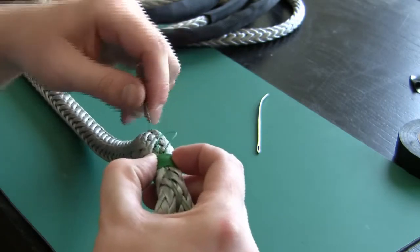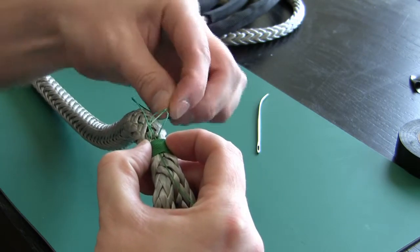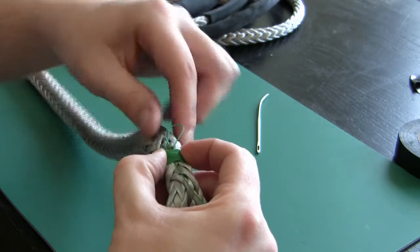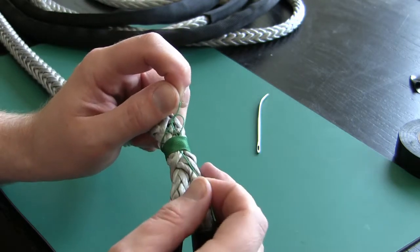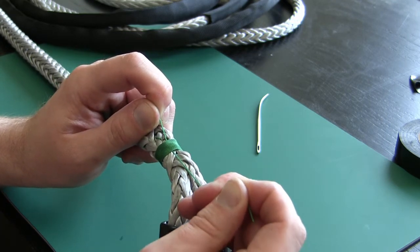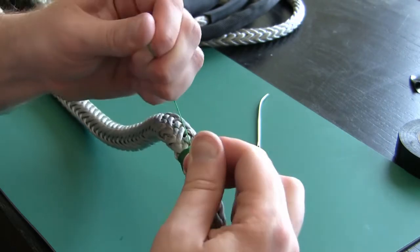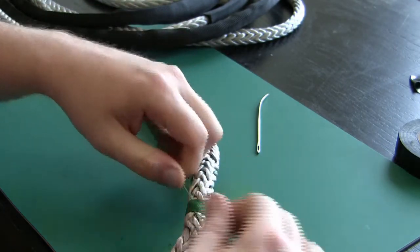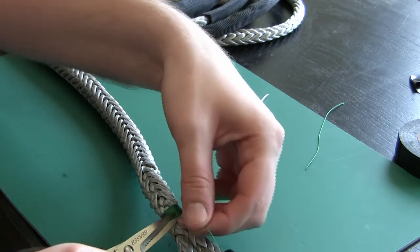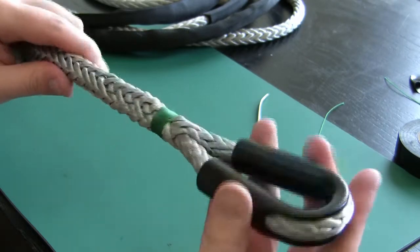This is how we make our knot without having it exposed. Take the end of the line and pass it into the loop that we've done the whipping over. Then with the tail of the stopper knot, you can see it pulls that knot inside. Follow the lump and watch it pass. Once it's centralized under your whipping, take both ends and pull it nice and tight. Snip off the tails right at the base of the whipping twine — make sure you don't cut any of the whipping. You've got a fully complete lock stitch.